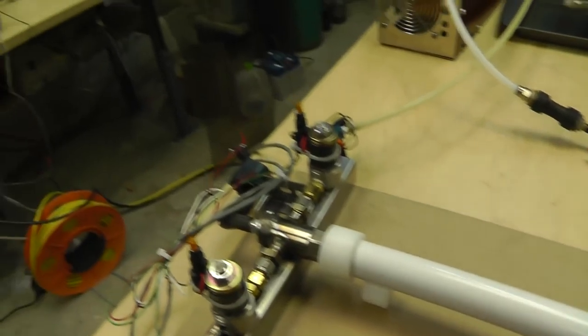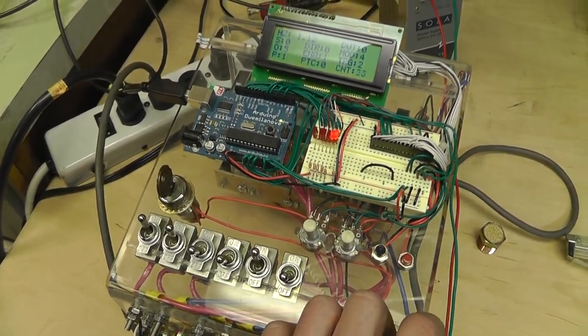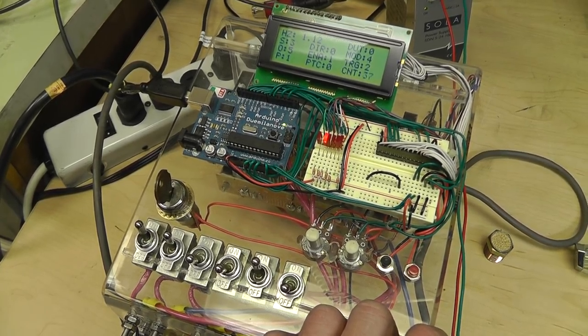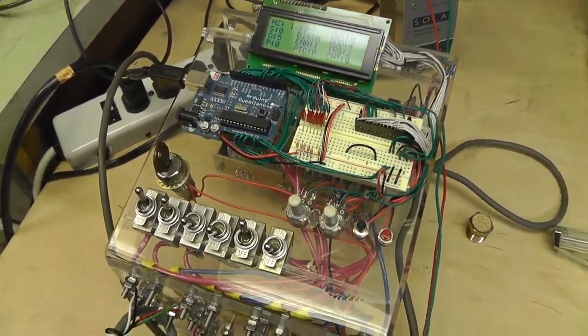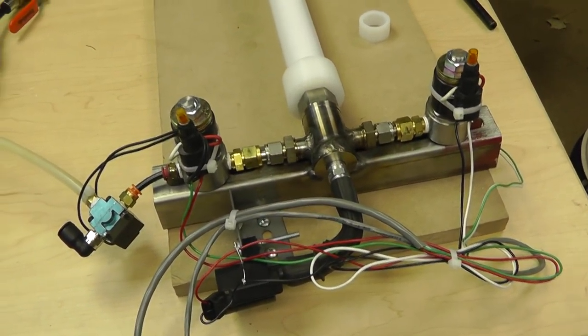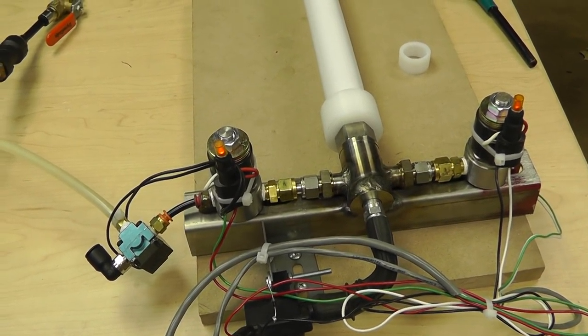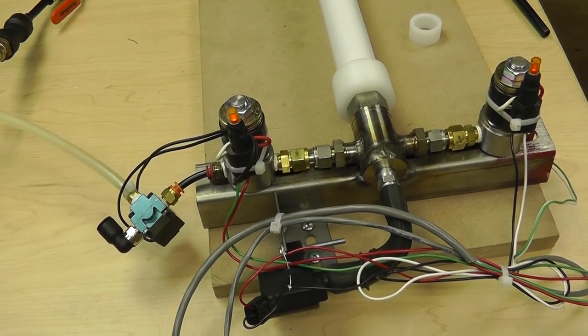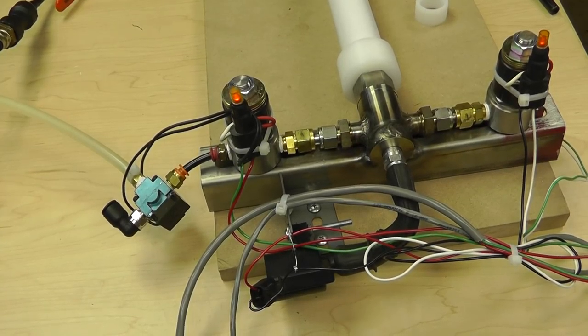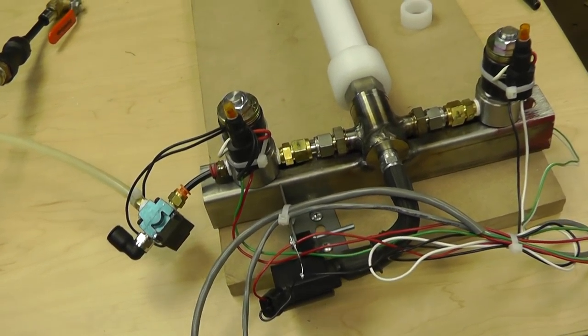And PulseFire, I'll show you how I have this programmed. When I hit the fire button manually, both the first outputs come on, then off, then it fires. It multi-triggers the fire. So I'll do it again here. Fire. Gas goes in, shuts off, and fires. Okay, so I've got indicator lights on here so you can see it. I'll do it again. There's those two on, there's off, and then you can actually hear the spark plug.